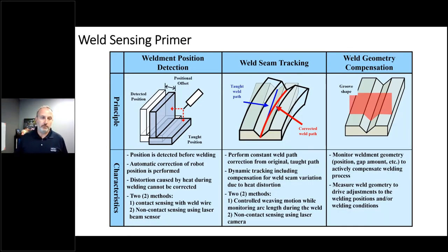Just to give everybody a primer on weld sensing: there's a variety of solutions this technology provides, from simple position detection before you weld — going out and seeing or feeling the part to see where it's shifted part to part — through what most people consider the holy grail of weld sensing, which is seam tracking. As you're welding, you're constantly looking ahead on the joint and seeing what's coming so that you can be constantly adjusting. Some technologies also allow actually measuring the geometry of the joint itself — what's going on with the shape and gap — and adjusting the process to ensure good welds within that changing joint geometry.